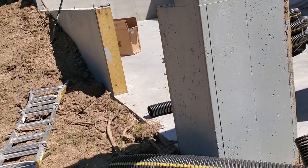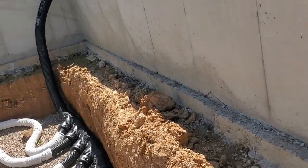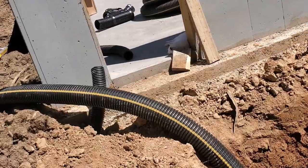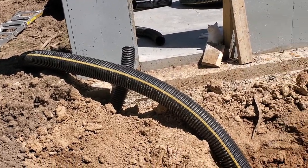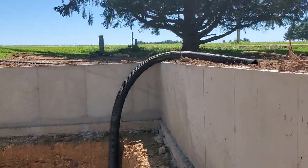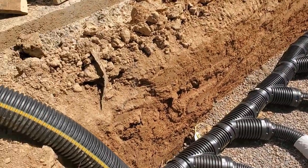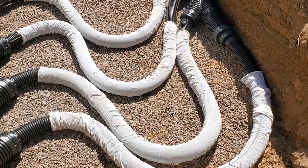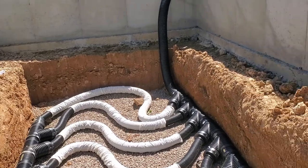Okay, so now the first circuit is down. You've got 6-inch feeder pipes, and they come down into some Y fixtures that are 4-inch, as I recall. That is the intake pipe there. Eventually, it's going to go right up to the very top of the Walipini, almost 16 feet up, maybe 15. And the other end there was the outtake, as it were. Blows the air out the other side. And I had to make sure that I had my Ys positioned so that they would be conducive to the airflow.